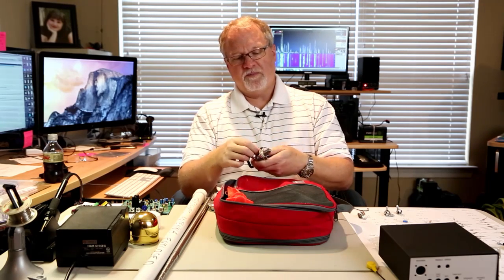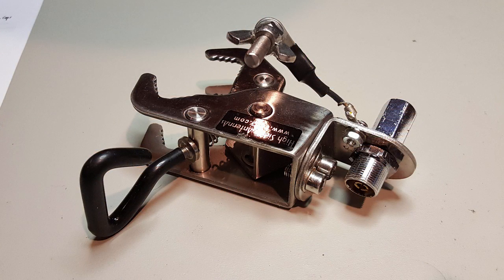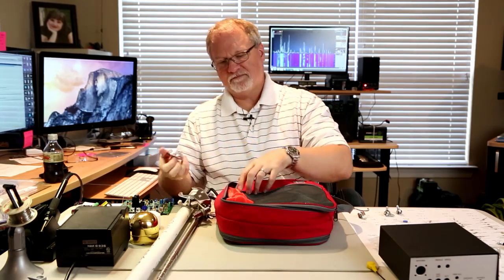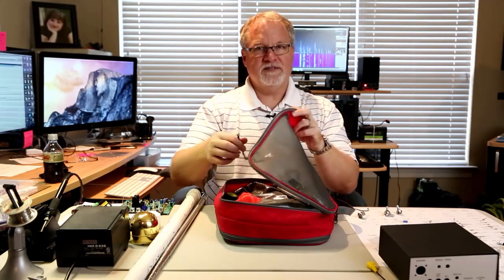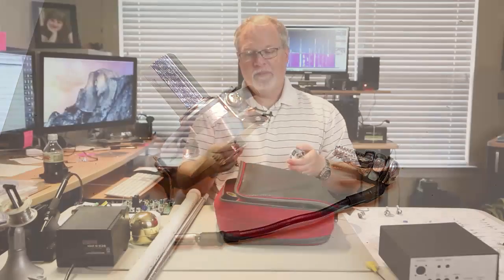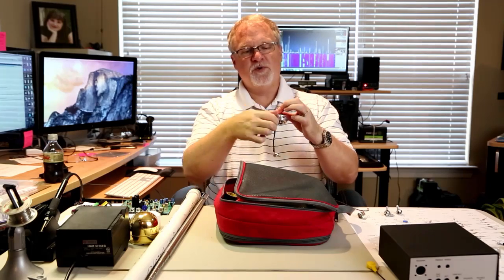There was a hole right here and I soldered a little wire onto a lug, put a bolt and a little nut against that. On the other side, I soldered another bigger lug that has an opening that a quarter-inch stainless steel bolt and wing nut can slip through. I attached my radials — which I've soldered lugs onto — into here, just tighten them down real tight on the little tripod mount. It has a couple of little quick connects to attach my radials to. I made a little pigtail that has a female quick connect on one side and on the other side has my lug with a stainless steel bolt and wing nut. So when I'm in the field, I can just clip this on and attach my radials. I've got two of these because there's two quick connects, and it helps me spread the wires out more evenly.